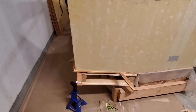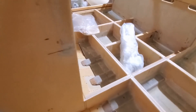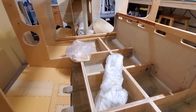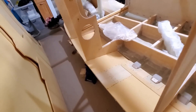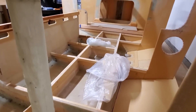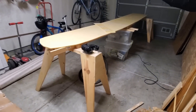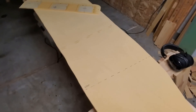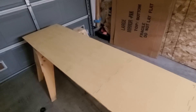I've got the port chine panel dry fit in place, just with some wood supports. You can see it over this way — get an idea of all the space inside the boat with both chine panels on. You'd think it was really wide, but it's only six feet wide. You can better see the supports for the panel and the three battens that rest up against it to snug it into place. I've got it on this makeshift table, and now I just need to add strips of 1708, just about this wide, that'll go under each frame. Then I'll slide it into position.